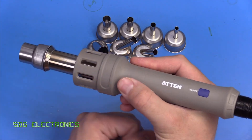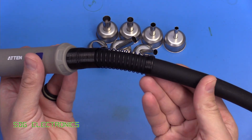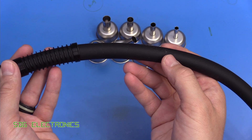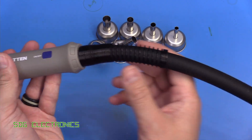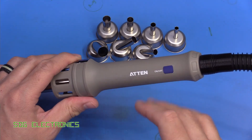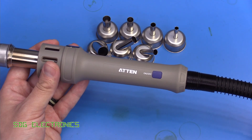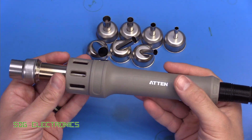There are a few differences in the mouldings which make it quite comfortable to hold, and then there's the strain relief and tubing. This is quite different tubing to what we've seen before — almost a matte ESD conductive tubing, really quite soft and pliable, but thick in diameter. Unfortunately, this is also the shortest tube yet, probably about 55 centimetres long. As a result, you really feel the strain from the main station because it stops you having much flexibility. The Metcal is quite amazing by comparison because it has a really thin but extremely long tube.